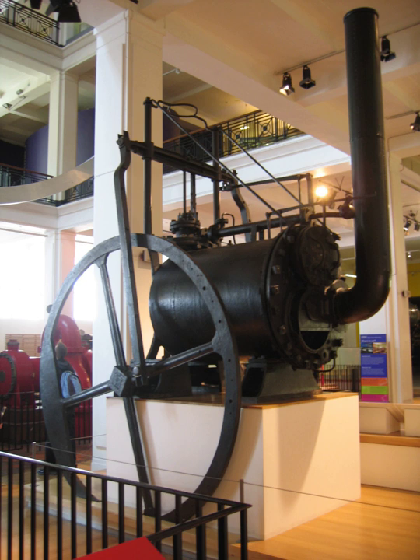This was a paired engine with two short-stroke trunk engines facing outwards. Their connecting rods from the pistons led to upright vibrating levers that could rock back and forth. These levers rotated a short axle shaft with further levers on it that in turn drove another pair of connecting rods and a shared central crankshaft. These complex engines were the invention of the Swedish-American engineer John Ericsson and were little used outside these two countries.